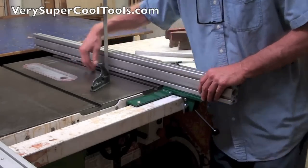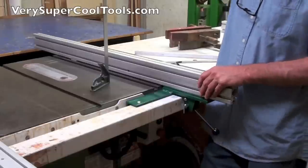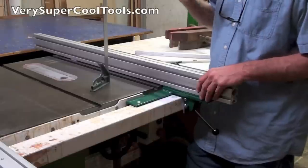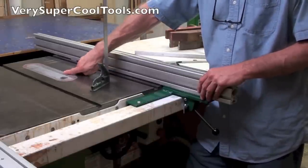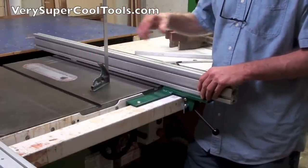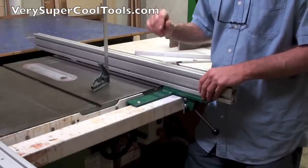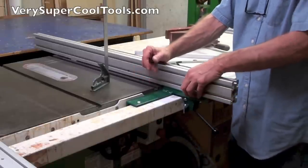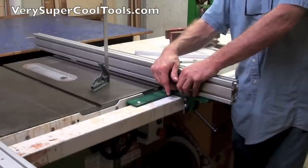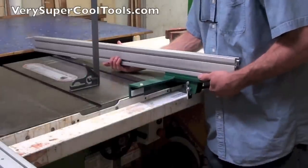I generally don't like to touch my beautiful extrusion to my carbide saw blade. Since all saw blades have a little bit of variation, a lot of times you have to zero each one out. My method is to measure with a ruler from the inside point of the rake of the teeth to the fence, set my pointer to that, take a test cut, measure that test cut with a ruler, and then refine my setting based on that test cut measurement. I have lots of scrap plywood I'll run through there for a test cut. It's pretty simple to set up and pretty simple to take off and get out of your way too.